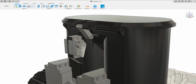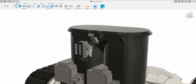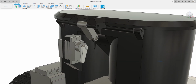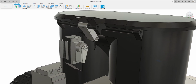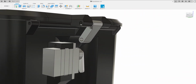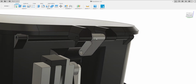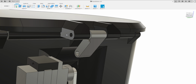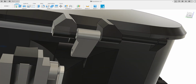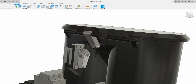And there's a few printed parts which you'll see in the printed box. You've got a plastic part that glues over this servo horn. And then you've got this as a lifting one. What I've been doing recently actually is using the sort of fairly rigid flexible filament as levers in here. I've put a lighter on one end, melted it a little bit to a flat point so that it sticks into there, goes right the way through, melted it on the other end, and then you've got a pivot point which works quite well.